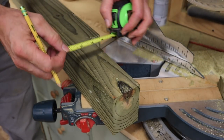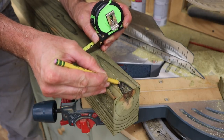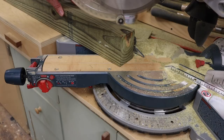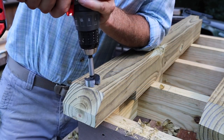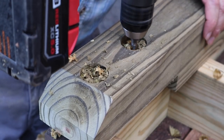For a little decorative edge at the bottom of the post, I'll measure in an inch and a quarter from the outside and just cut a 45-degree angle. I'll pre-drill and countersink the post in preparation to attach the table to the dock with lag bolts and washers.